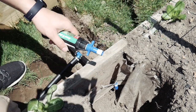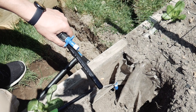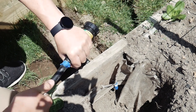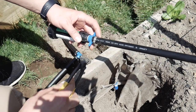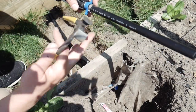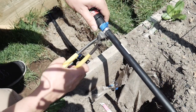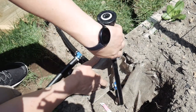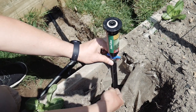I'm adding the half-inch part that goes inside the sprinkler head and then into a piece of poly pipe. These are two-by-tens on the side, so they'll be around 12 inches — perfect to have that two feet from the bottom and then go up another foot. I'm showing you all these little steps assuming you might not know how to do this, and I made this video with an average consumer in mind who doesn't know how to use these pliers or make everything watertight.